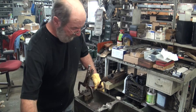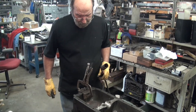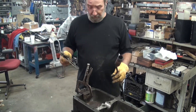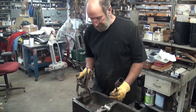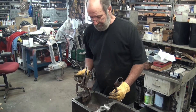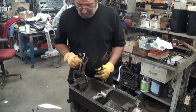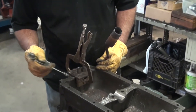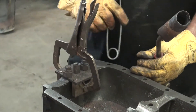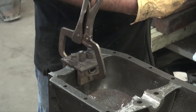I want to keep the front one up again to the 400-ish range. To restate: there's more mass and material here, so I'm going to do a lot more concentrating underneath and in this area to get it up to 400 plus. Where this side is pretty thin, there isn't a whole lot of material there, so it doesn't take long. I'm going to spend a lot more time on this side getting it prepared and up to temperature.